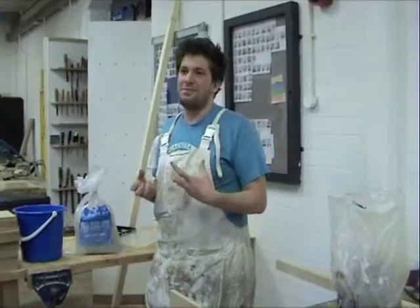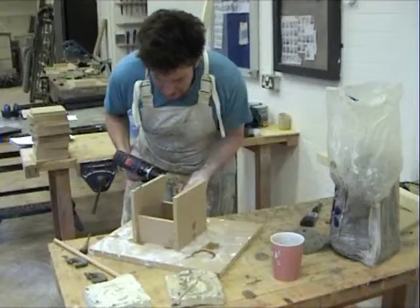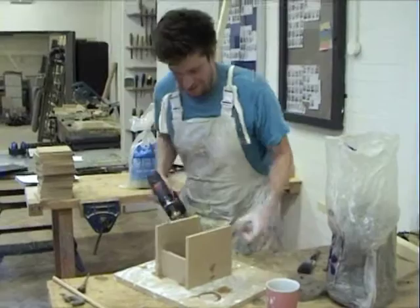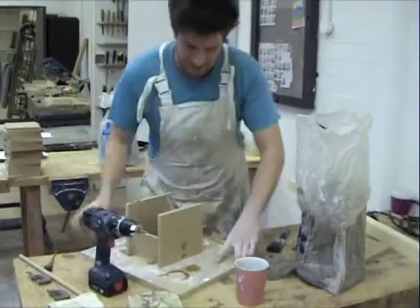Casting plaster just sets harder — that's the main difference. Building plaster is quite crumbly, so when you're getting this sort of thickness, casting plaster is just going to hold. A lot of people with sculpting forget that sometimes the whole process is a little bit tedious, and you do have to be prepared with little bits of cuts and bits of wood and all this stuff.